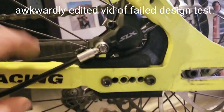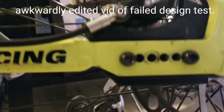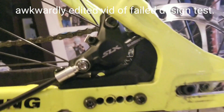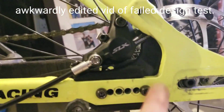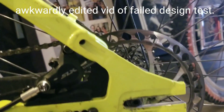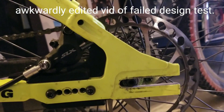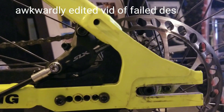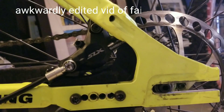I'm going to think about this and see if there's a way I could bring this down just a hair further. I don't think I can, because this bolt is about as low as I'm going to be able to place it under here. If I can rotate it maybe a degree or two forward, I might be able to make this fit. This would be better — less metal in the final product, which means lighter. It also puts the forces of the brakes closer to the frame, because when it's on that big adapter up here, it makes a giant lever — and the longer the lever, the more force you're putting against the other parts. But anyway, this was an experiment. This is the closest I can get it so far.